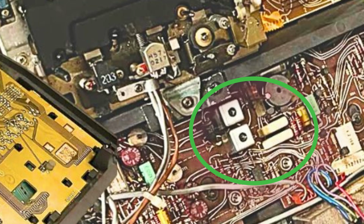There's always a coil and a capacitor because we're talking tuned circuits, which means that a job that would normally, you just take out a capacitor, a couple of minutes, but you've got to actually realign the circuitry afterwards, and it's not going to be easy. If you're not up to it, then you're going to have to get a tech involved.